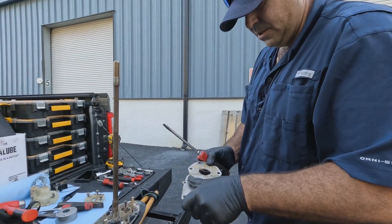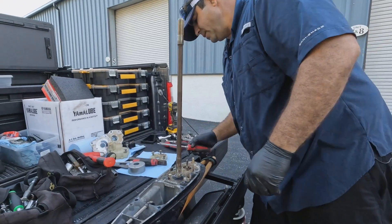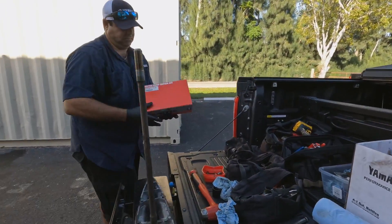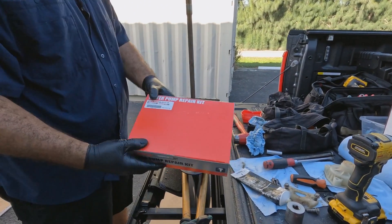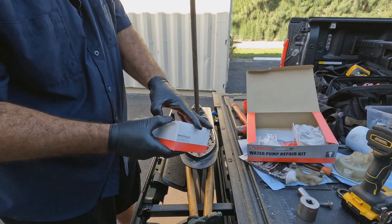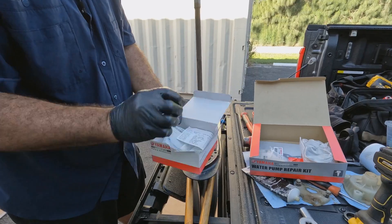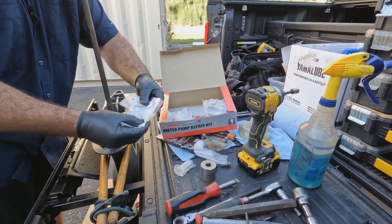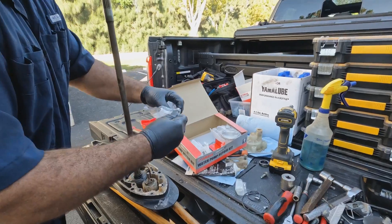This plate looks okay, pretty good. We're going to go through the whole kit so we can visually see what it's detailed for. This particular short shaft VF 250 is going to take a 6 Charlie Baker water pump kit. It comes with all the parts — not everything, but most. Doesn't come with the housing, but it comes with all the other parts: the dowels, the o-rings that go in the water pump housing, the woodruff key, and four new bolts.